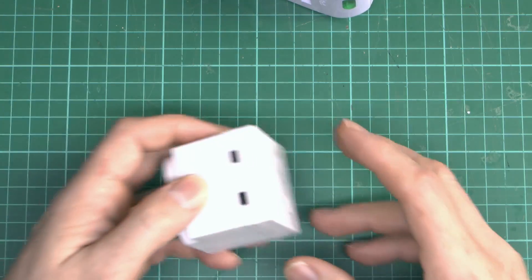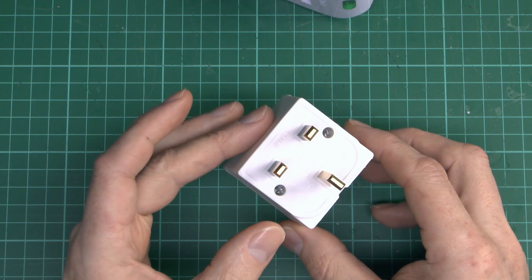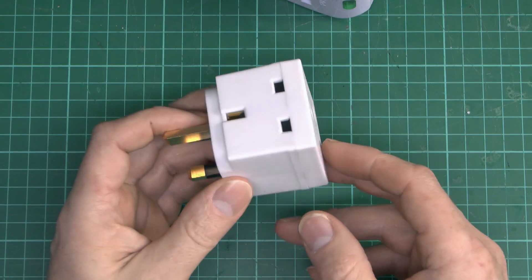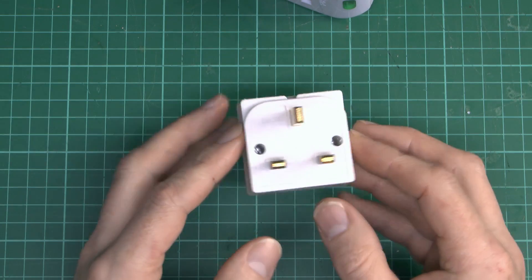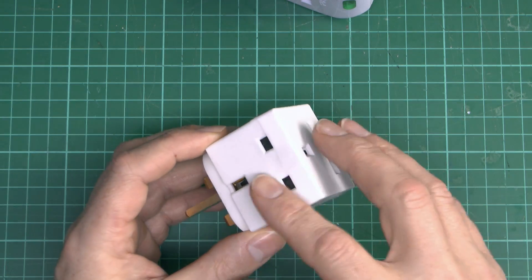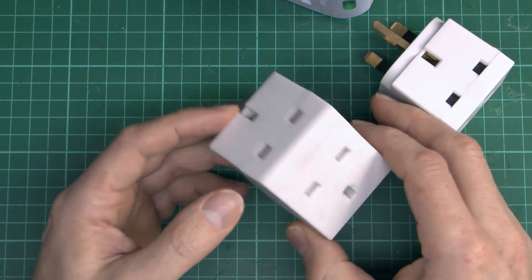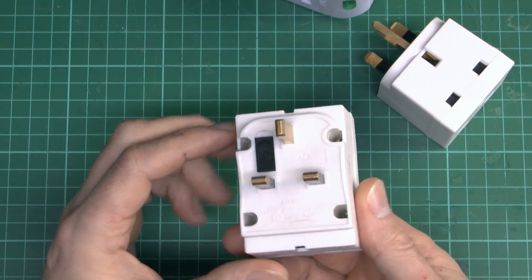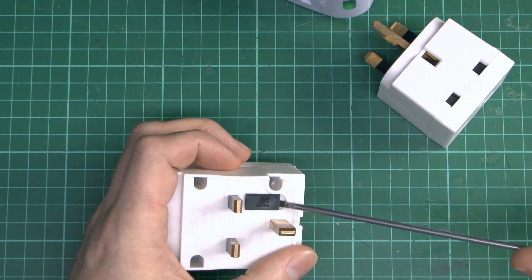There are a few of these alternative devices. This is one of the more dubious choices — this thing just plugs in, and you've got two outlets, so you can get two things plugged in at the same time. This particular style of two-way adapter is a bit of a problem because there's no fuse in it, so in theory you could plug two 13A items in here — about 3kW each — and have twice the rated current going through the actual socket. There is also a three-way version, which does actually have a fuse, so in case of overloading you can only get 13A out of the whole thing.